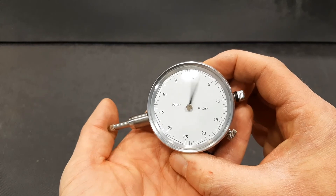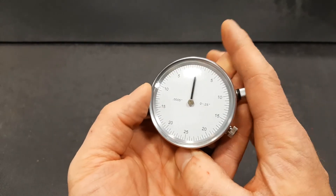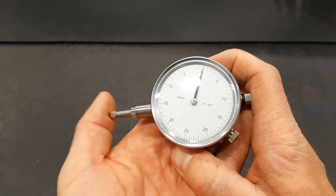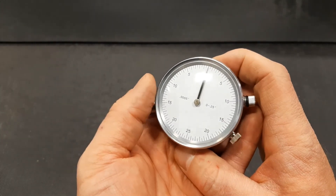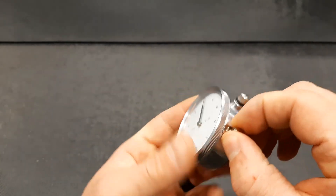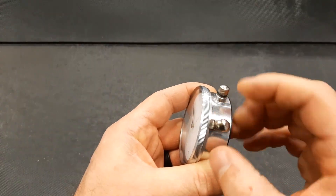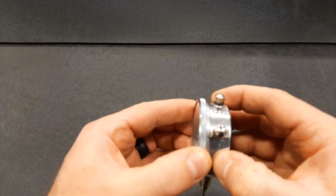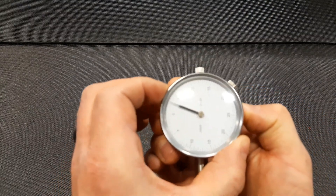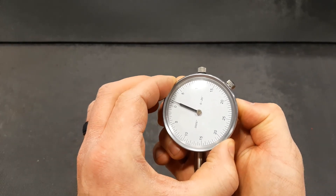The plunger here moves on the top as well, so we've got to make sure we don't put anything over top of it that will interfere with the plunger's movement. With the dial bore gauge this really isn't going to be an issue. We also have another dial with a thumb wheel — if we turn it to unlock it we can move our ring to zero the gauge, which is going to become important.